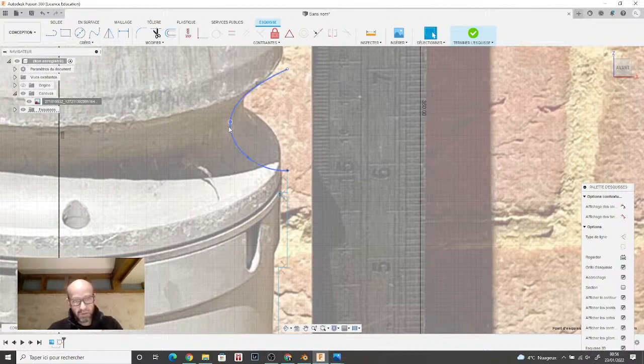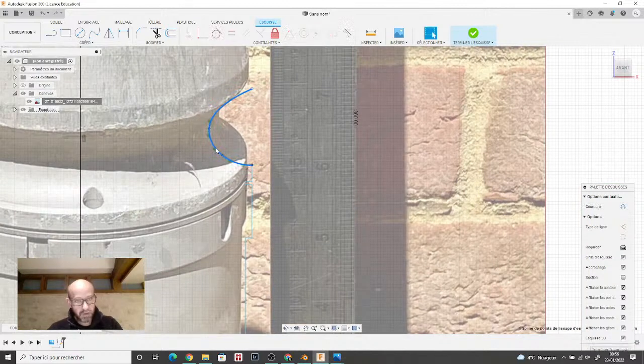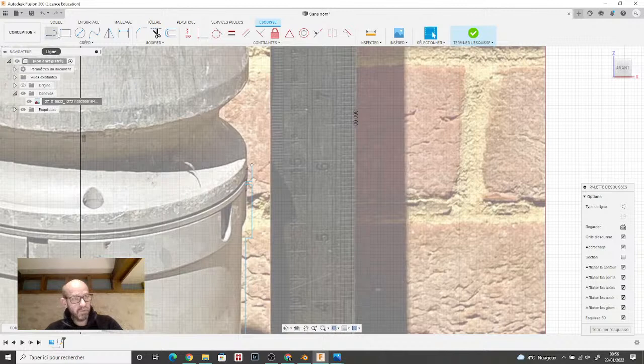Here you could decide to put it at the middle of the groove. Let's do it. At the middle of the groove, I can decide I have a symmetry. So I take a construction line and say my middle of groove would be somewhere here. You see, I show this line, and so Fusion takes it as a reference and shows me the square angle. And now I'm going to come back to standard line, and I make half a groove,